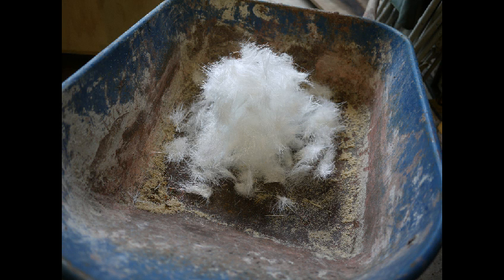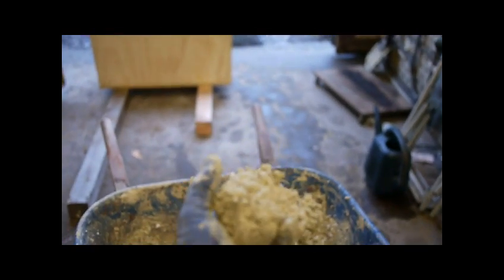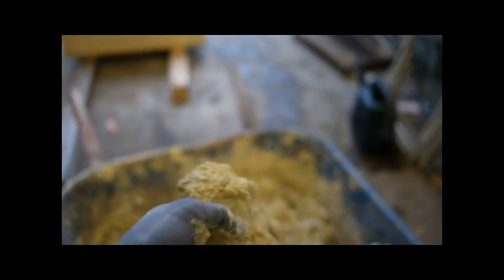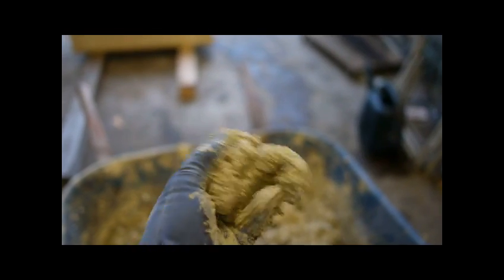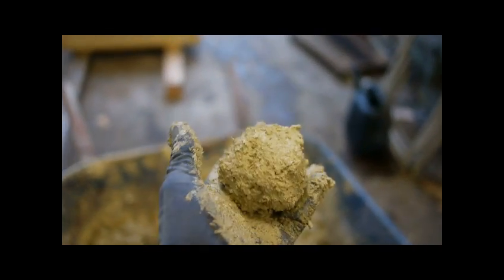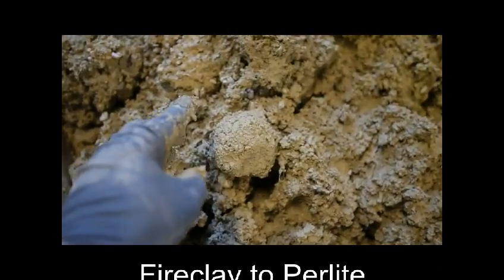Here is the beginning of the material. I did use fiberglass — that's matte fiberglass. I tore it up with my hands and made little fuzzy wispy bits. Then I mix my materials. The mix: I've thrown in about 14 parts fire clay to 14 parts perlite to 1 part fire cement. You want to add just enough water so that you get it dry enough to handle, dry enough to make balls, but that when you roll it in your hands you can stick it back together again. It should hold its shape when you toss it — you should be able to catch it and have it retain the ball. You don't want it really wet and slurry.